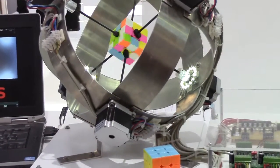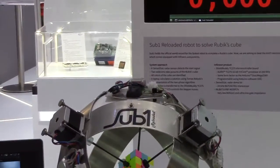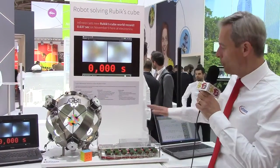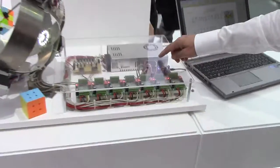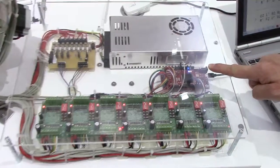At the moment the shutters of the cameras are closed. Once the system is started, the shutters open and look at the Rubik's Cube, then calculating the time-optimized solution, which is then executed by the motor control based on an Infineon Aurix microcontroller running at 200 megahertz with its three cores.